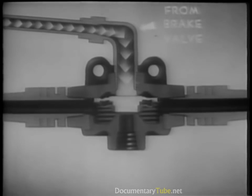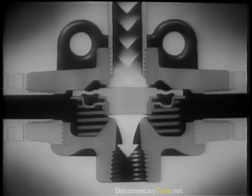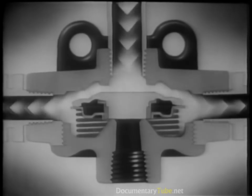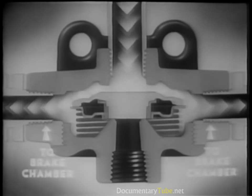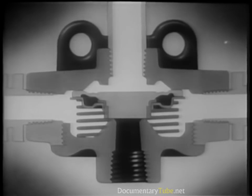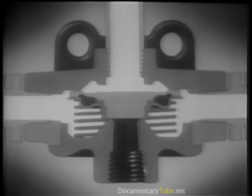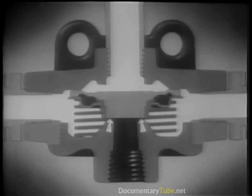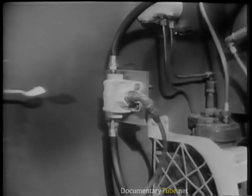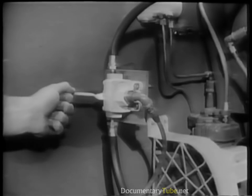When the brake pedal is pushed down, air rushes in from the brake valve, pushing the diaphragm down. When the diaphragm moves down, it cuts off the air escape to the outside. The compressed air surges through the two side ports, each of which leads to the brake chambers. When the pressure above and below the diaphragm is equal, the spring closes the inlet port, and the center of the diaphragm keeps the exhaust port closed — this is the balanced or lapped position. When the brake valve is released, there is no pressure above the diaphragm, so the spring returns the diaphragm to its seat, blocking the passage back to the brake valve but opening a shortcut directly to the outside. The air in the brake chambers escapes quickly without traveling the long route through the airlines to the brake valve.